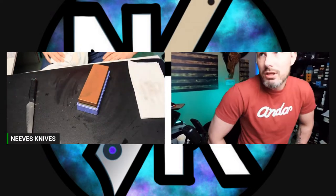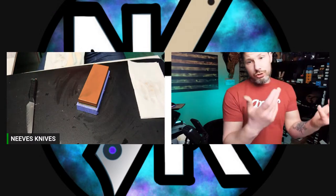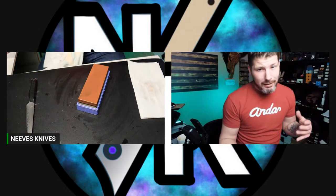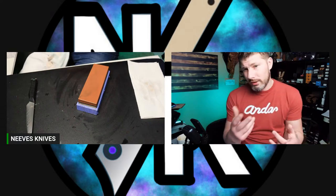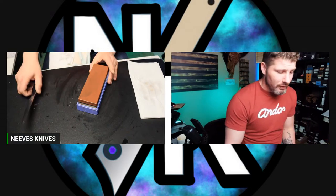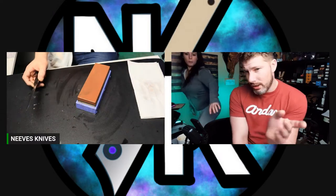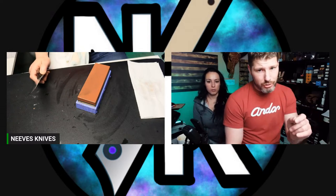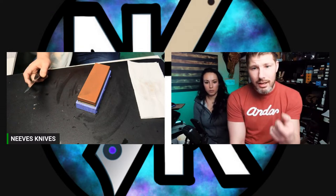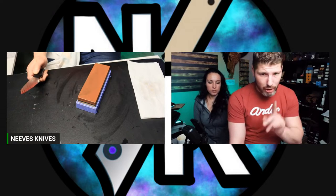Say if I was doing a 300 grit edge, right? I want a super toothy edge. I'm not most likely going to use my 300 grit to deburr. I'm most likely going to use a finer stone or a ceramic and then a strop. About 600 grit and up, you can use the stone, but you got to be gentle. No pressure, because you're not trying to create teeth. You're just trying to snag the burr, which we're going to talk about in a second.